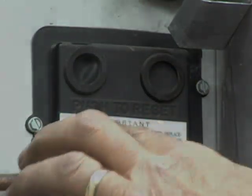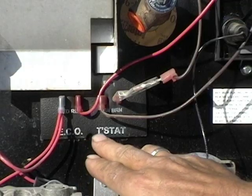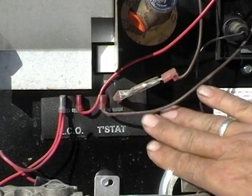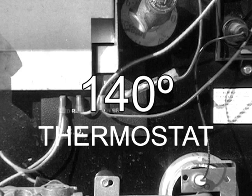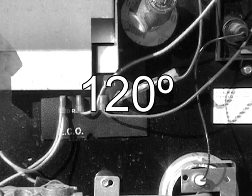You can't adjust the thermostat on automatics. If you'd like the water a little hotter, you can have the thermostat changed, but this should be done by an RV tech. In the early years, manufacturers put 140-degree thermostats in the water heaters, but some people were getting hurt with water that hot, so they set them at 120 degrees and gave the customer the option to increase it if desired.